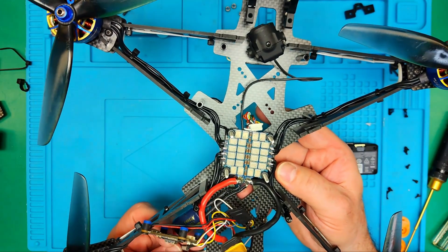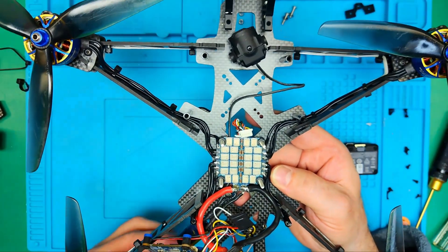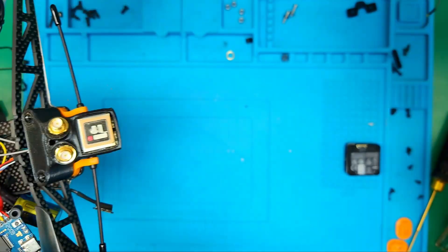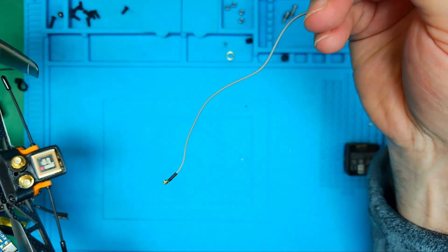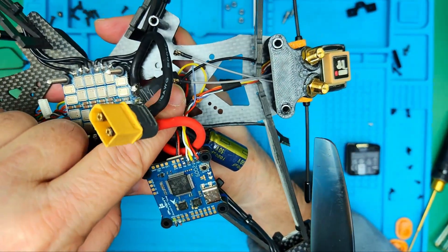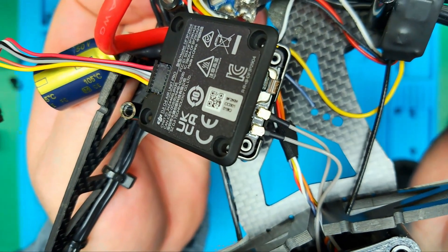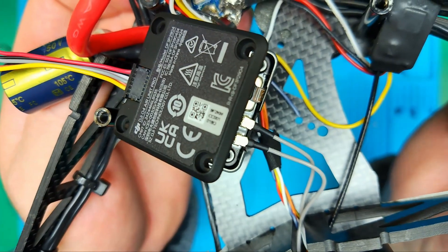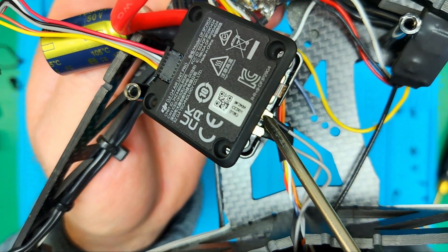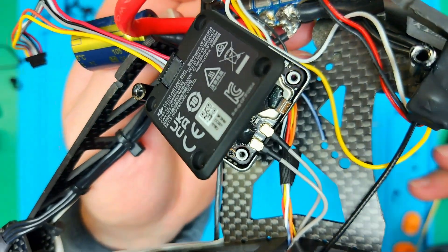There is no air unit on here yet — it will be installed next. There is nothing pinching the line going up to the camera. The camera is ready to be reinstalled. I switched out these longer antennas that I was previously using for a lot shorter ones which terminate here, and this is where the air unit will be put. The antennas are now installed onto the O4 unit and they snap right in place — no fussing, no messing around. If it doesn't go in, just make sure it is straight and snap in. You do not want to stress these connectors on the board because they can come off very easily — make sure they don't just snap right off and you will be good to go.